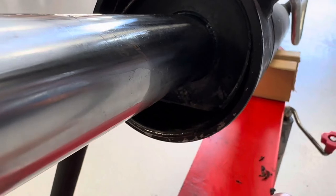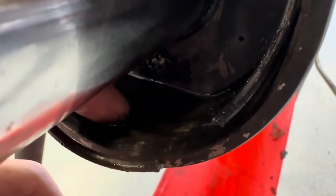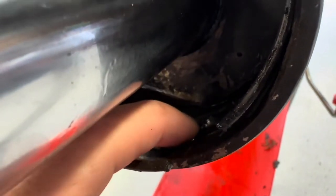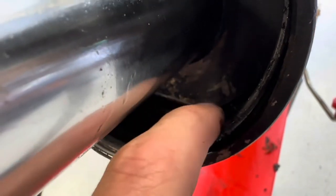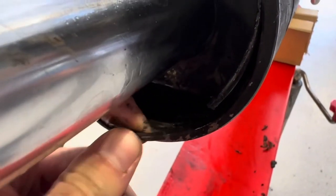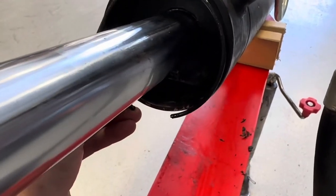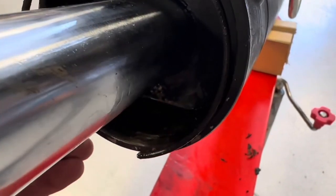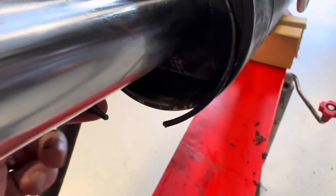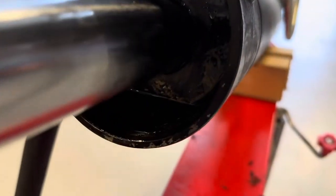I used a flat head and found the corner of the wire and pried it up. There's a little groove it sets in — that groove is sharper coming out and slopes going in. Push the wire in and around, and once you get to the top that bottom end can practically be pulled out by hand. Just push back a couple inches, then start pushing in and that other side will come out towards you. Note that this still has a lot of hydraulic fluid inside.